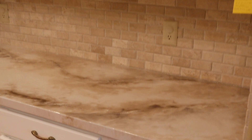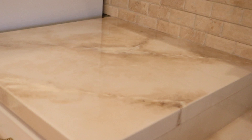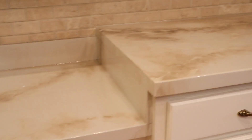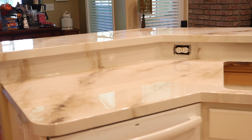This part here came out a little bit darker than the rest of the counter. You'll want to take off the backsplash tape when the epoxy is still a little bit tacky — don't wait until it's completely 100% cured. Use a razor knife to score a line and then pull that tape off. It'll be a lot easier to take that off. Let's see how nicely the colors go with the backsplash and the sink area — another vertical surface there that came out pretty decent.